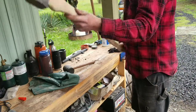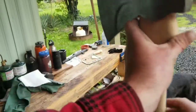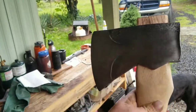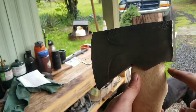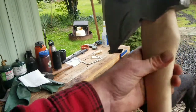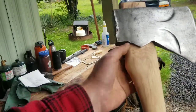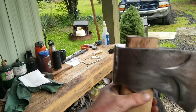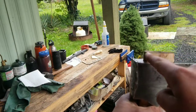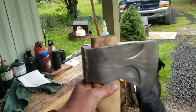I like it — I think that's as good as she's going to get. I went back and repeated that process: knocked the head up, shaved some of the wood down, just trying to get it down a little bit further. I think it's about as far as it's going to go. Now I'm going to put it in the vise and cut just a little bit off the top to try and help the wedge go down deeper, then we'll go over wedging.